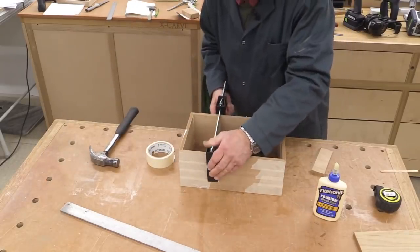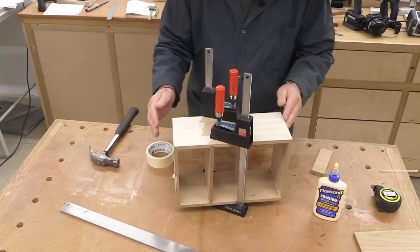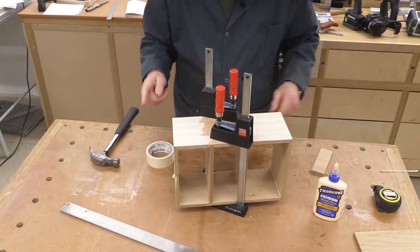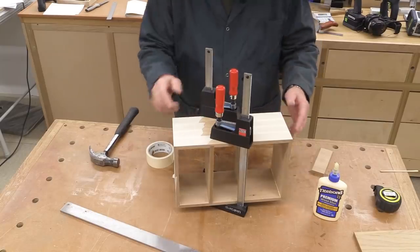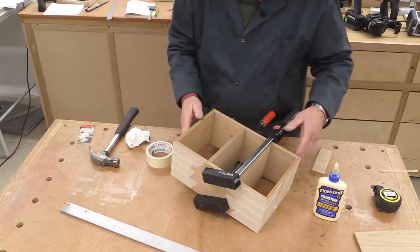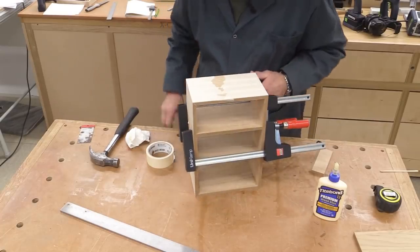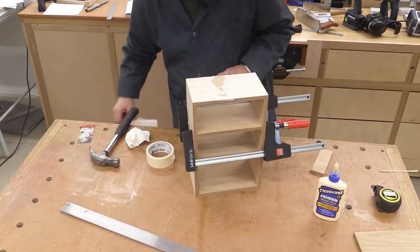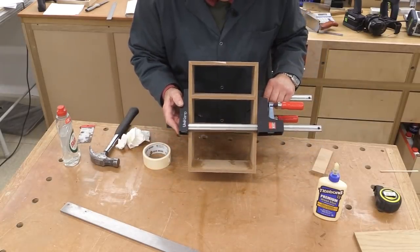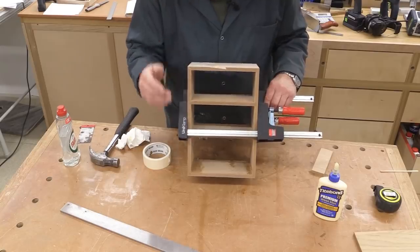My corners are taped up, everything's looking good, and I think my shelves are in the right place. I'll give that a little tap, make sure it's all nice, and I'm just going to give this a gentle squeeze to make sure it's well seated. I'll put a pair of clamps on there really just to hold those two shelves - I don't want to put screws or nails or anything like that. I'm now going to wipe off the excess glue which is down in here at the mitre joints.